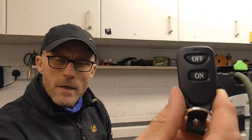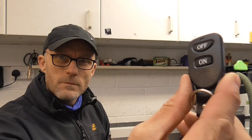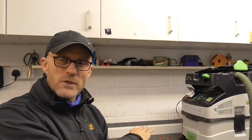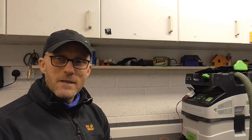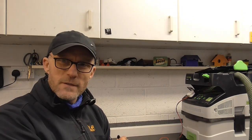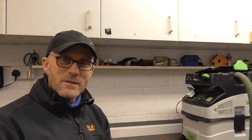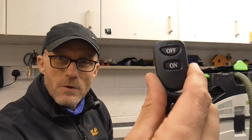So I had a little look around and I bought one of these really cheap 240-volt remote controls off eBay - I think it was about eight pounds - and I've wired it into a really simple circuit. It's a bit messy at the minute and I'll try to tidy it up and put it in a more presentable package, but basically what it does is it switches through onto a 35-watt light bulb and that makes the extractor start.